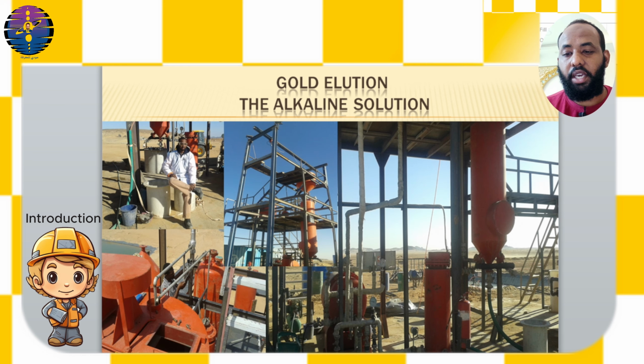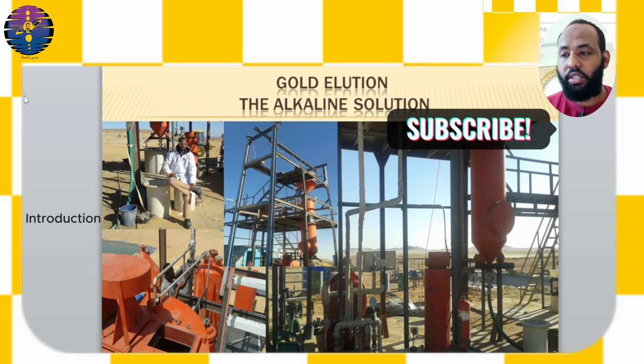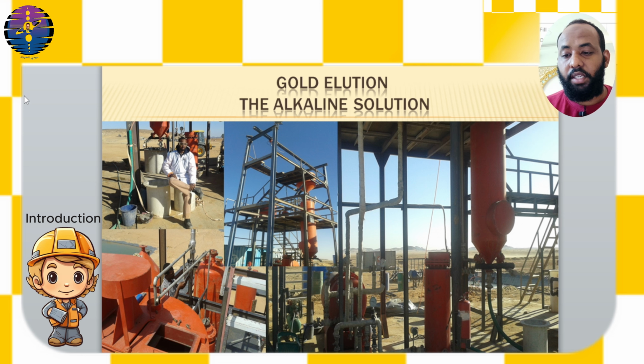After this stage, we move on to the extraction or stripping stage, which involves gold elution. This process involves subjecting the carbon to a removal process or stripping process using a hot alkaline solution, sodium hydroxide and cyanide, to release the gold back into the solution.